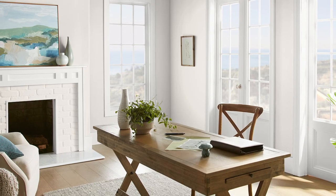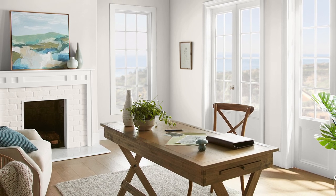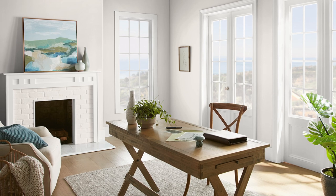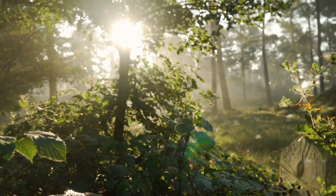Even though it's an off-white, it's soft and neutral enough that it behaves the way a normal white paint would. The undertones are fairly balanced, giving this color a very easy and pleasant appearance. Similar to an actual pearl or a pearlescent finish, Pearly White can sometimes show two different sides of itself depending on the situation. When you just look at it, it seems to be a little more towards the warm side of neutral — it has a beige quality to it, and even a little bit of a brown coloration. But curiously, this color was part of the Sherwin-Williams Cool White color collection. That's because sometimes Pearly White can show the slightest bit of a green undertone, especially in areas with a lot of cooler light, which further reiterates the importance of testing colors. I wouldn't go as far as to call it a greeny beige, but it does have that possible green undertone that can show up from time to time.